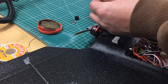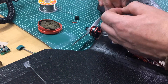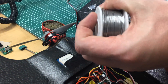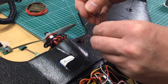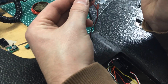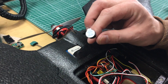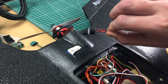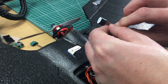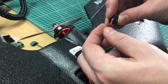Because we need to connect the wires to the buzzer. I started by splitting the wires and giving them a little blob of solder. Then I tinned the pins of the buzzer and also gave them a little blob of solder. Don't forget to add a little shrink tube around the connections, and of course keep in mind that PLUS is marked on the sticker and the red wire should be connected to it. After having checked your connections, place the shrink tube where it should be and heat it up so it will do its job.